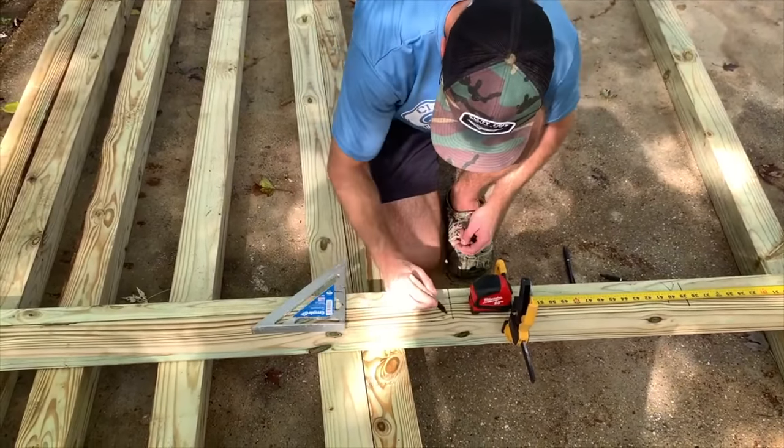After thoroughly spreading out the slick coat with the squeegee, I took a 3/8 inch nap roller and I rolled the entire application area to give myself a nice uniform slick coat across the entire floor. I used a 9-inch roller to get on the inside corners and those hard to reach places against the wall, and I used an 18-inch roller for the middle of the shed just to make things go faster.